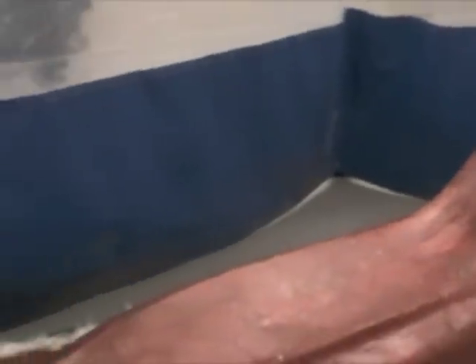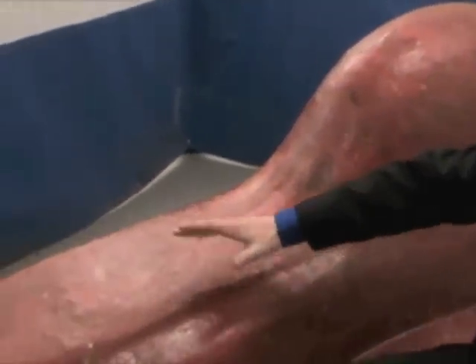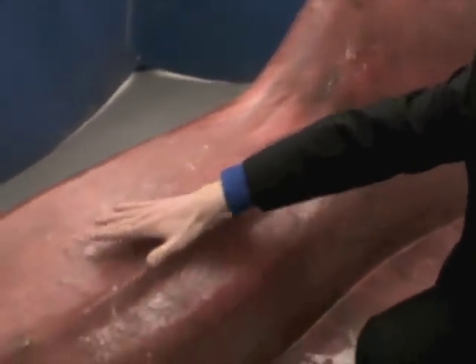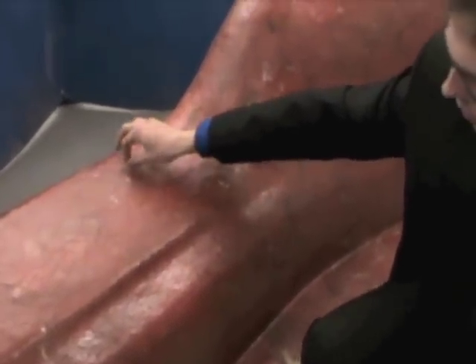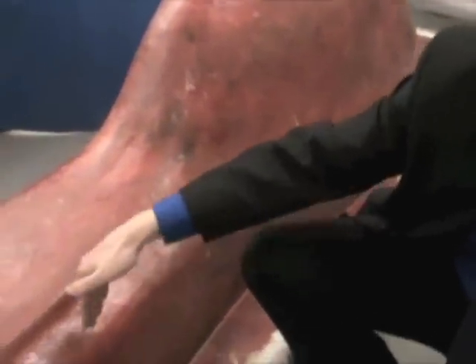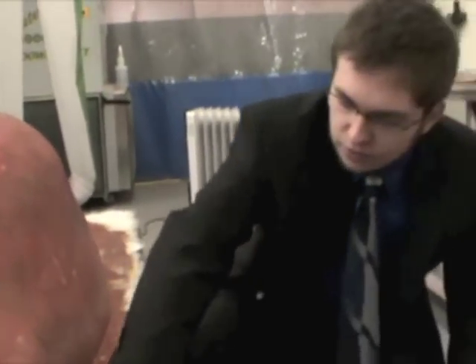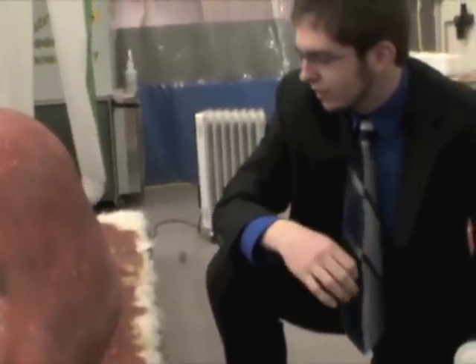For instance, when you mirror the two halves — you build one half and then mirror the other — we had this bump where the hole had to be contoured. I would literally pick a point and drag it up a little bit, then pick another point and drag it up a little bit. It's a lot of fine-tuning, especially right here where the wheels come out. We had to allow for the turning radius, so we compressed the body in with the airfoil design just enough to allow about one inch of clearance — which is crucial, because you don't want the body scrubbing on the wheel.